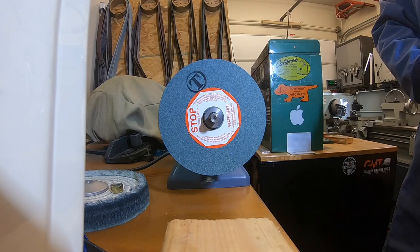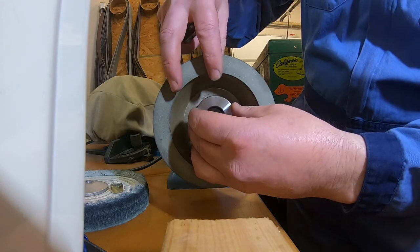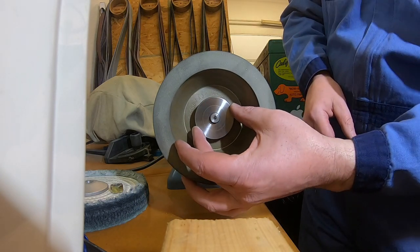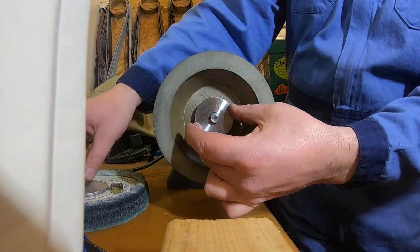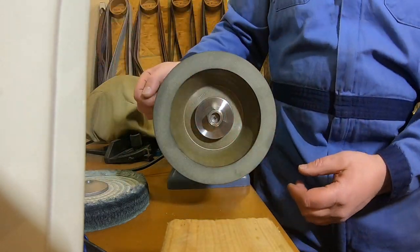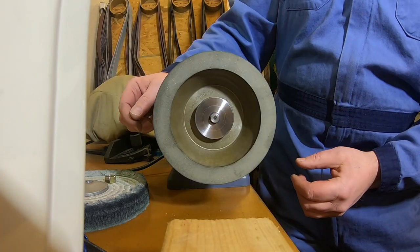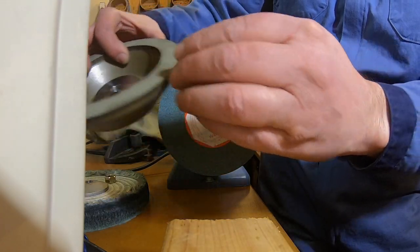All right, so we've got our first piece on there. We've got the grinding wheel on. Part number 2. Get part number 3 in there. Or sorry, part number 2 is in there. And then part number 3. Nice fit over, and doesn't look like we have too much nut right now, but again, we're gonna move all that on there another 3/8 of an inch or so after we cut that notch. But so far, it is looking just like it's supposed to. So let's get over to the mill. Let's cut the notch in that first piece, and we'll really get this thing put together properly.